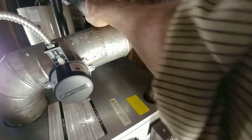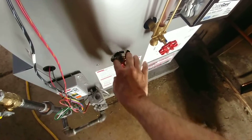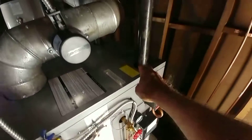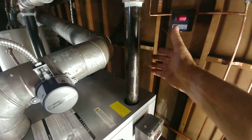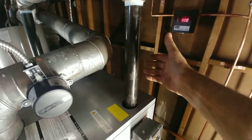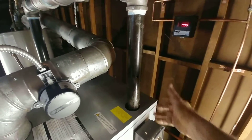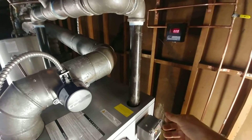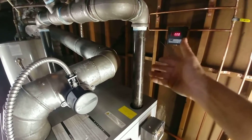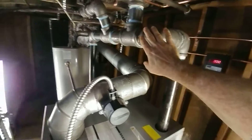Normally this would be on the other side, bringing the equalizer line down here. We had to impact this bushing from the other side with considerable difficulty and install it here, then come up with a 2-inch by 24 nipple. I'd like to see U.S. Boiler install 2.5-inch tapping here, but they're afraid contractors won't want to buy a 2.5 by 2 bushing. So what we do is use a 2 by 2.5-inch 90 and go with a 2.5-inch header.